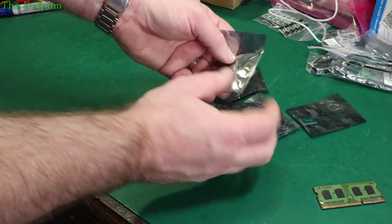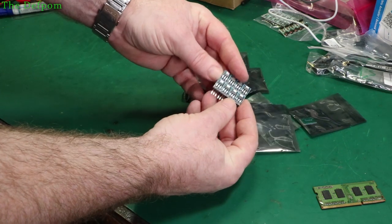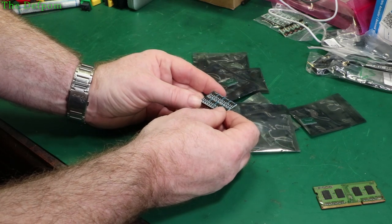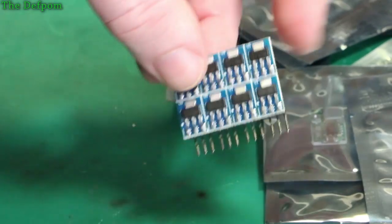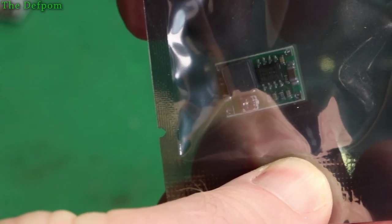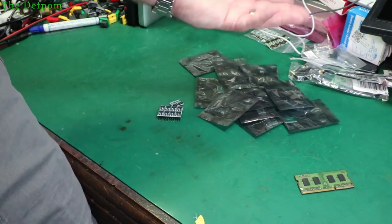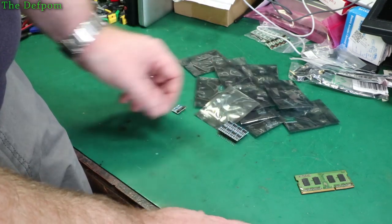These are either booster or buck converters — it's another little switch mode thing. And we've also got some more linear regulators. These are AMS1117 3.3 volt regulators — linear 3.3 volt in a handy package, looks like the 7805. And this other one is adjustable as well. Having a stock of them from time to time is quite handy, because when you need to build something you've got the bits and pieces. Power supply stuff is always something you use.